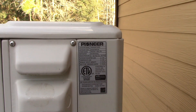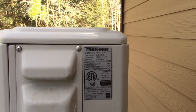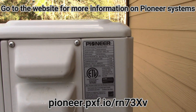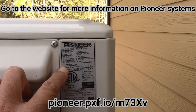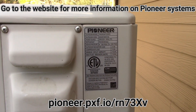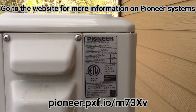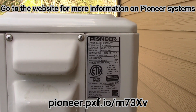Normally, code says breakers and wires have to match — a 20-amp breaker uses number 12 wire rated for 20 amps. Air conditioners are a little different, which confuses many electricians. So basically what I'm going to do is take my minimum circuit ampacity of 10 amps, multiply that by 240, and that will give me my wattage — 240 being the voltage, 10 the amperage, which comes to 2,400 watts.